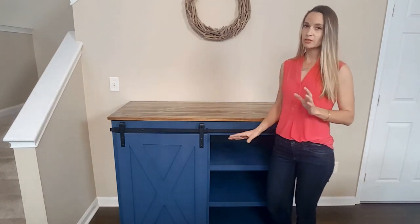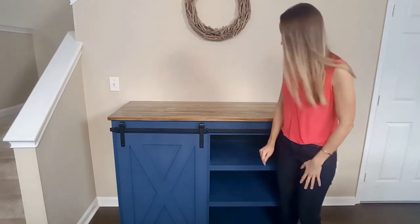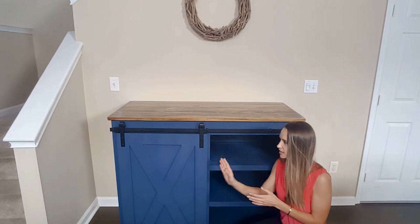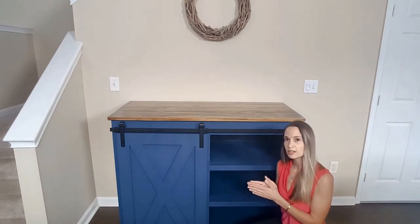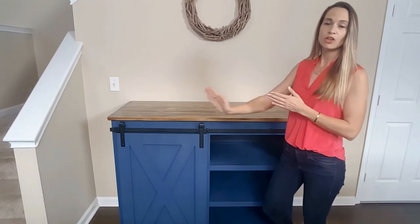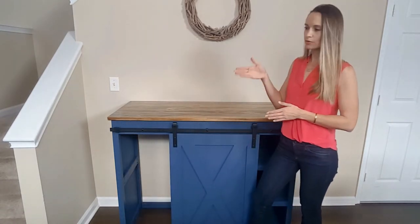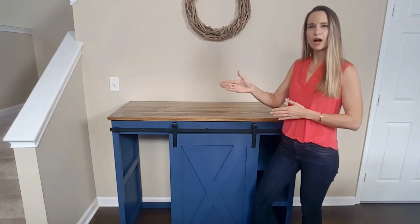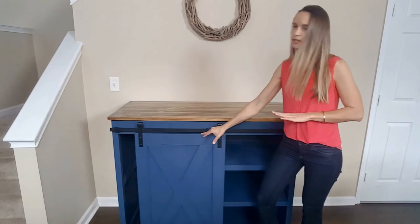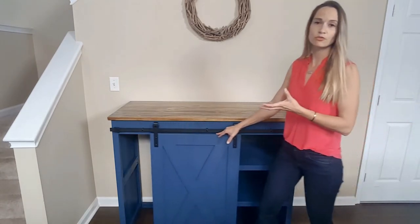Another thing on the center bottom — it's a little hard to see in the video, but I'll put up a picture as well. There is a piece at the bottom where I cut a track down the center bottom of the barn door, so it gives space for that track to ride along inside the barn door. As it goes along, it keeps the barn door level and prevents it from popping out from the bottom. It goes along really smooth and fully covers the left and right sides for symmetrical spacing.